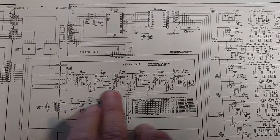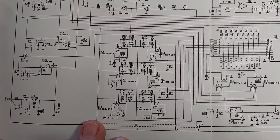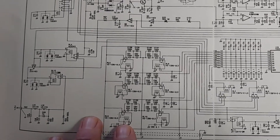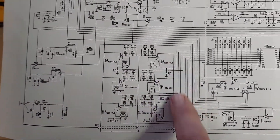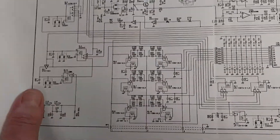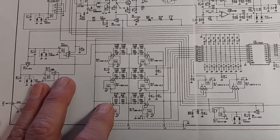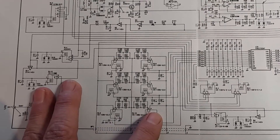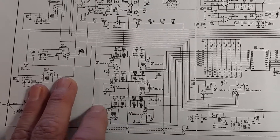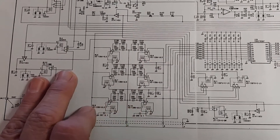That tells me all the inductance relays are working, so the problem is probably in the capacitance-switching section — one or more of those relays that switch capacitance in and out. There are three relays for each tuning cap, giving about 16 combinations of capacitance. We'll open this up, identify which relay is engaged on 15 and 10 meters, try some contact cleaner, and if that doesn't work I've got relays on hand.